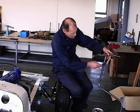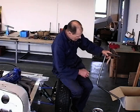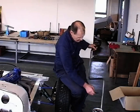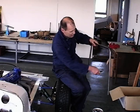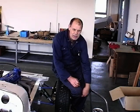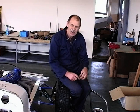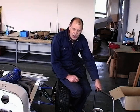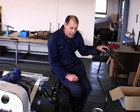And all we do, we measure the straights, that straight there, that straight there, that straight there, and we just cut through it, like that, like that, like that, and then we cut that leg there with the same length there. So we cut that into four. The reason we give it in that form is that it's obviously less work for us to do, and it means you get it in one piece. It's the kind of thing that you don't forget, you remember it continuously. And you can't lose one of the brackets. You cut that up, and that's giving you four neat hockey stick shaped brackets.